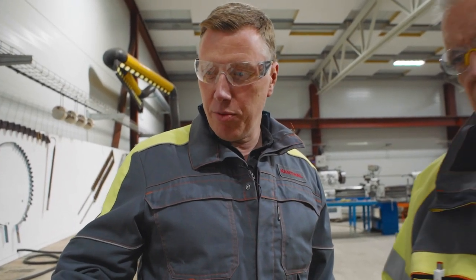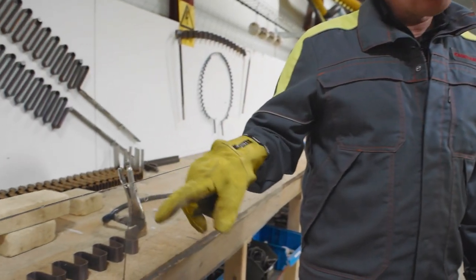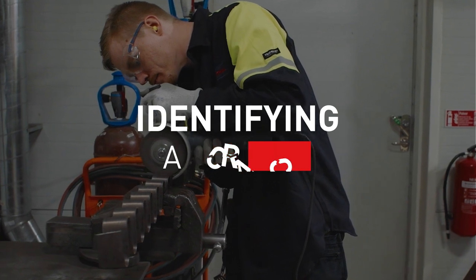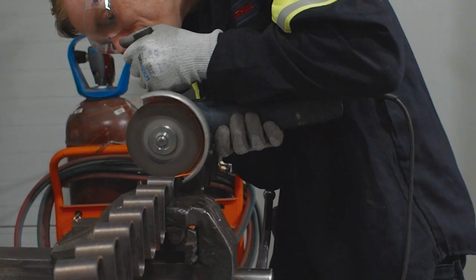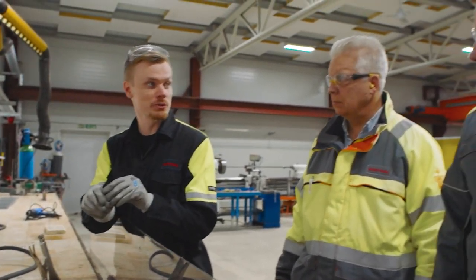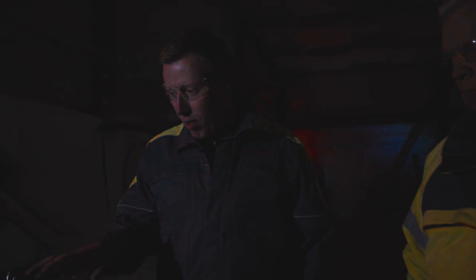Torbjörn, we have formed a really good element here. We have put the current through, we have got it hot, and it has got no cracks in it. We are now going to show everybody where there is an element with cracks in it, and we are going to make that crack. We will make an element where there is a failure on it so we can show how a white spot looks like. Why is it going to glow white in that area? Because there is the same amount of current, but the surface area at that spot is lower. We have switched off the lights now so we are going to be able to see our crack more easily — by the eye you can see it, but the camera may not pick it up as clearly.